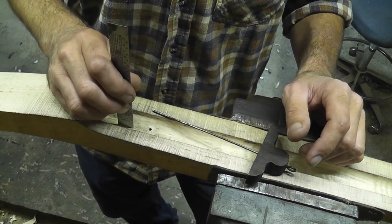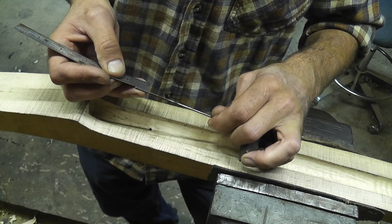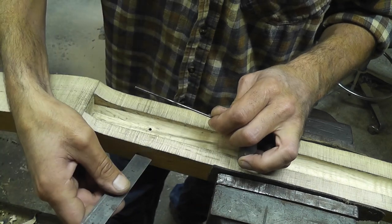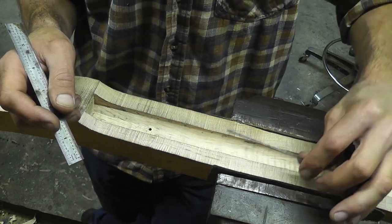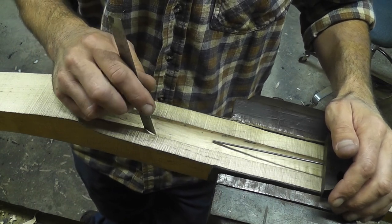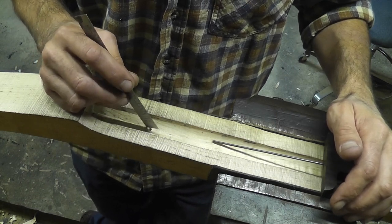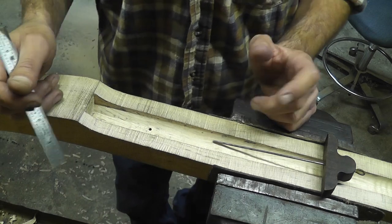I could take the barrel down another half inch since we're at five-eighths of an inch — it's a little less than five-eighths. I'm not going to, since we're using a 10-32 lock bolt through the side — that'll leave us plenty of room. But if you were building a really slim rifle like a Lehigh Valley or something like that, you'd want to reduce that web thickness substantially and maybe even use a 6-32 or 8-32 screw through there, making your webbing an eighth of an inch or even less. It would make the whole gun a lot slimmer right through this area.